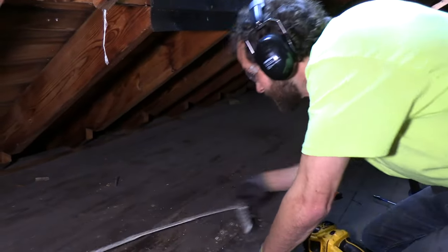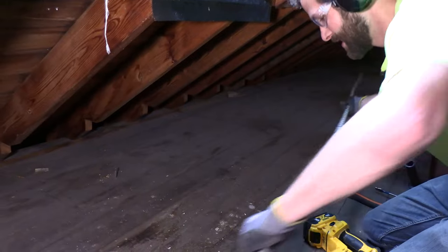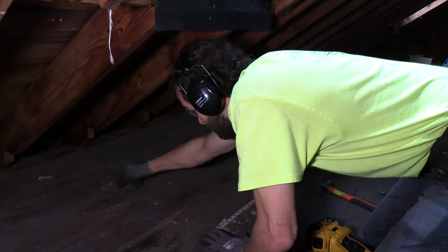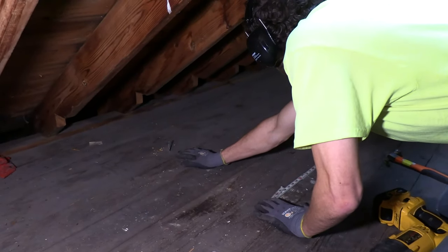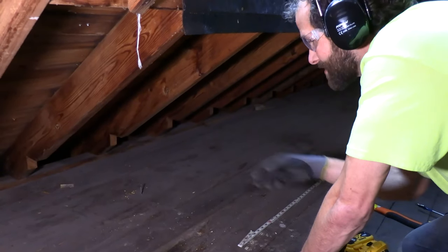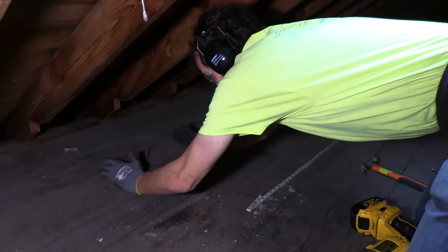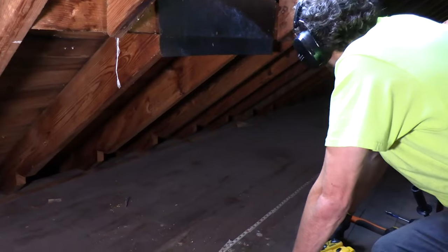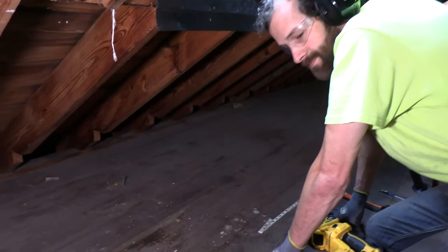All I really need to do is pull up one floorboard. I need to come out my 23 inches — and that's this floorboard — and if it runs continuously my 70 inches, that's beautiful, and it does. I'm going to pull up this floorboard, and probably the adjacent one, so I can get fasteners onto the can light to secure it and clear away the insulation. These are 16-on-center boards, so I can easily re-secure them. Getting the circular saw, hearing protection, safety glasses, full face shield.